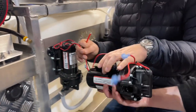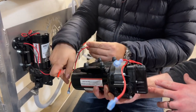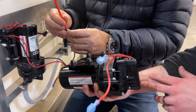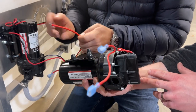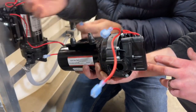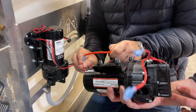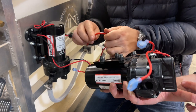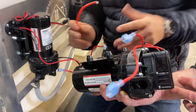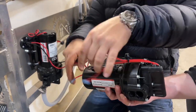Let me call in reinforcements — Jacob, come and assist. We're just going to cram that end of the wire in there, same thing over here, basically short-circuit the pump. It's not really a two-man job but we're making it one because we're trying to film. The gauge wire is way too big so it's not cooperating great, but when we make this circuit — it helps if the switch is on — you can see the pump does come on and try to run. The pump is fine.